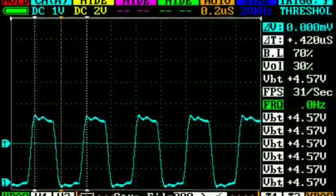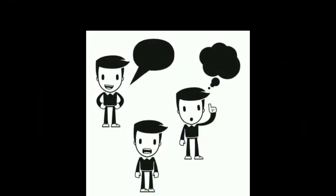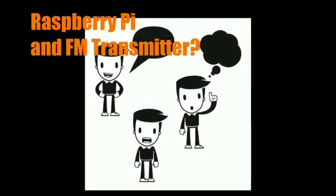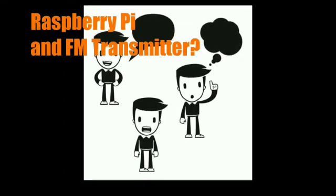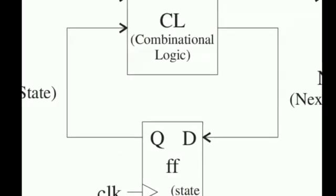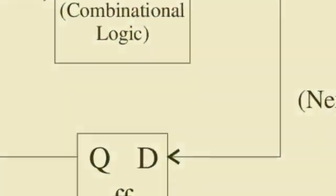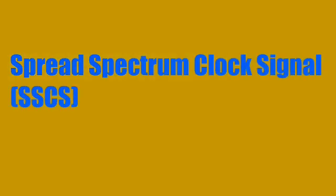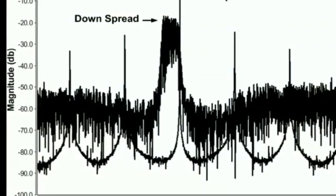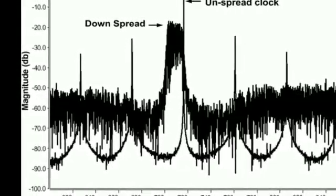Moving on to the working, our project uses the general clock output to produce frequency modulated radio communication. One common question that might arise is how can a Raspberry Pi, a board which is intended to be a microprocessor development board, act as an FM transmitter without any additional hardware? Well, every microprocessor will have a synchronous digital system associated with it, which is used to reduce electromagnetic interference. This EMI suppression is done by a signal called Spread Spectrum Clock Signal, or SSCS for short. The frequency of this signal can vary from 1 MHz to 250 MHz, which luckily for us falls within the FM band. So by writing a code to perform frequency modulation using the spread spectrum clock signal, we can tweak the Pi to work as an FM transmitter.